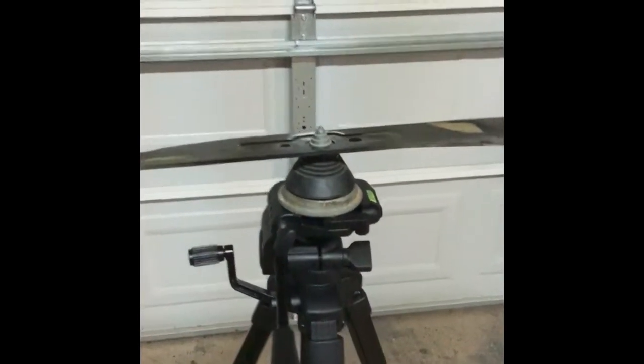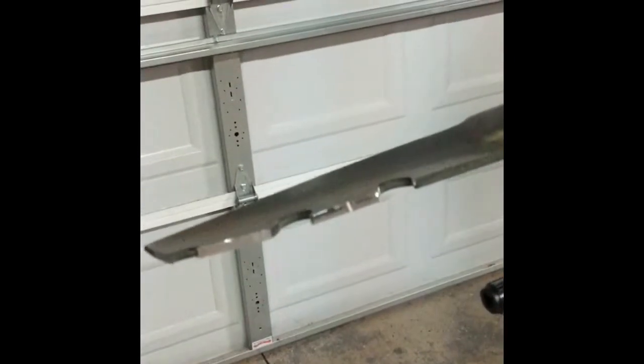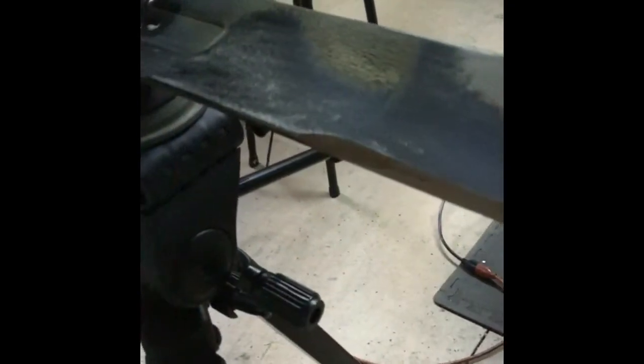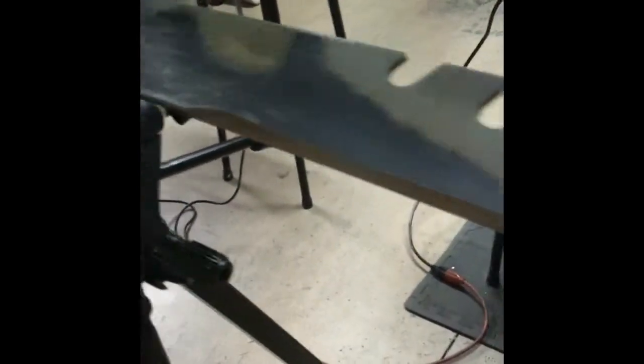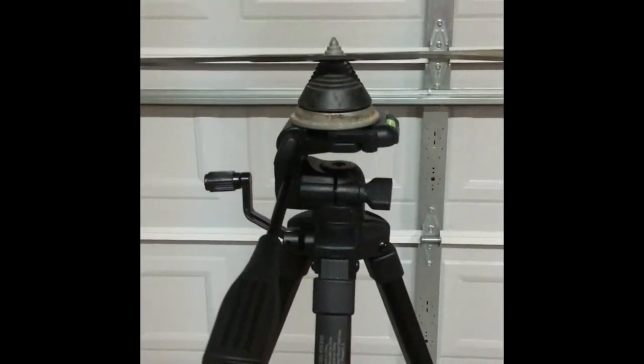The first time I put it on there it actually wasn't balanced, because like I said earlier that's where our rock chip was, so I took a lot more metal off of this side. But I took that into account as I kept working on it. You can see we actually ground a little bit off the back with the bench grinder and then worked on the shoulder a little bit more on that side than the other side. For that I used my automotive grinder with a stone on it. I think this is going to work good — pleased with it, and hope you enjoyed the video. Thanks.